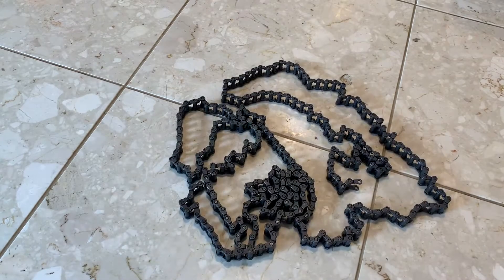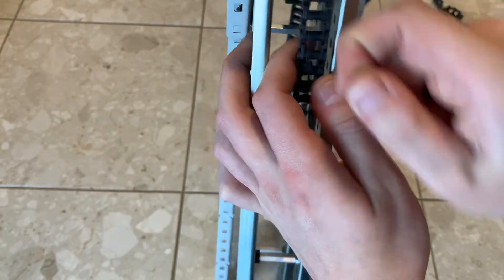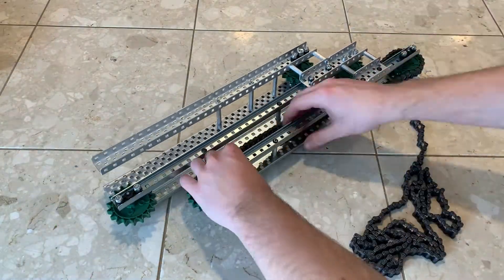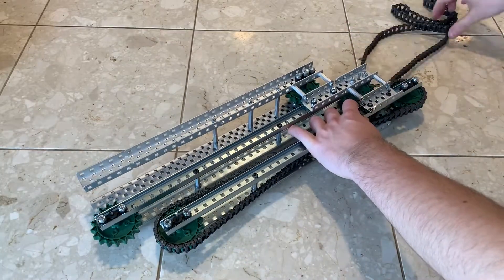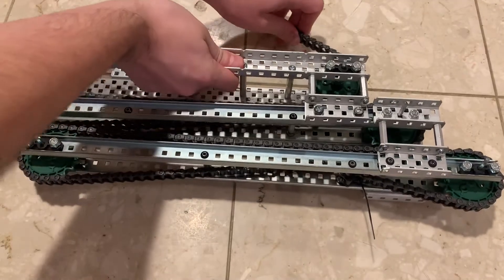The real question here is how to power it — that's where the chain comes in. You need a lot of chain here. I like to start with the end: zip tie it to one of the standoffs and then start wrapping it around. Loop it over one sprocket, weave it back to the other side and around the lower sprocket, then over the top sprocket of the stage below. Keep doing this until you reach the end, then pull.